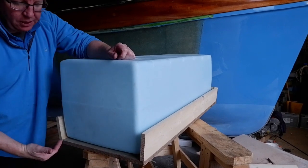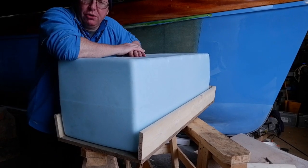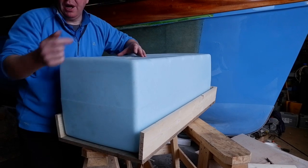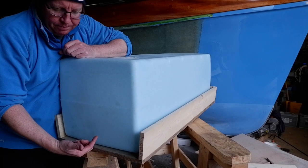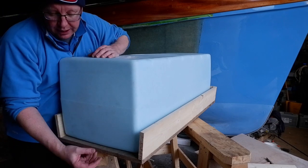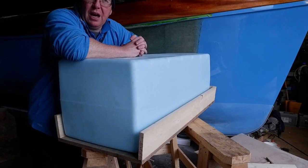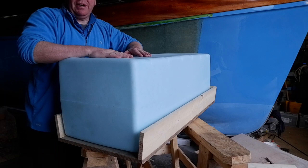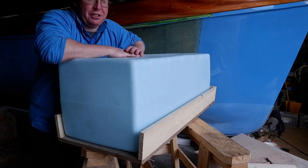Anyway, I made a lovely tray, which is going to be fitted. However, what I wanted to do, I might actually consult you guys, is we put the fuel in, fuel out up the top here. However, what I was thinking about doing, I had this in the rock hopper as well, was putting a separate outflow at the bottom, so if there's any rubbish that settles in the tank, when I come to clean the tank out, I can just turn a tap and all the rubbish comes out the bottom. Now, I don't know if this is MCA passable, it's maybe something I'm going to have to investigate more. However, that was my thinking. And it should all fit inside the boat because I've had a rough fit of sizes, etc, etc.